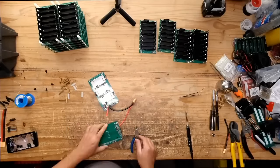So if you pick, like, three panels, you can add three panels in a row, because any more goes over the 65 volts. So really, you shouldn't buy anything bigger than like 150 watt panels, because anything else in that will be wasted.